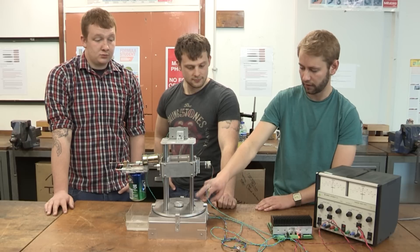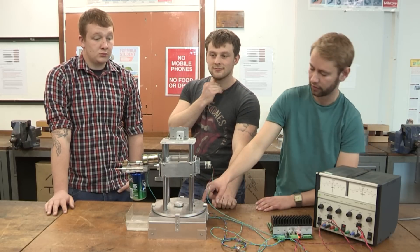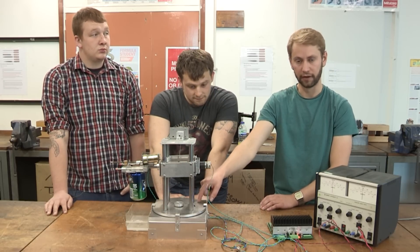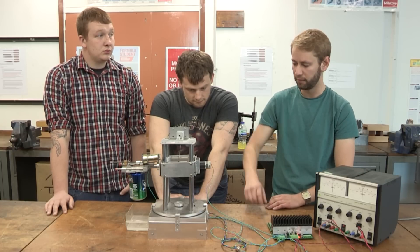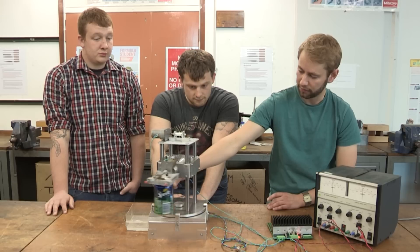These two are basically a giant bearing. There's a groove cut into the surface of that — the top's left of that and the underside of this — to hold an 8mm ball bearing. I think there's about 50 individual balls in that, so that's got a pretty free rotation.